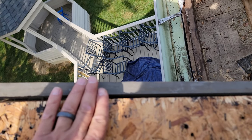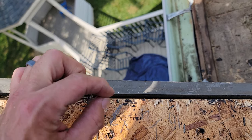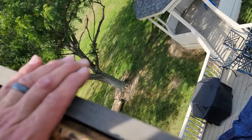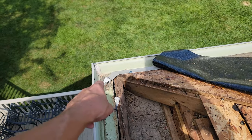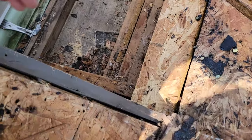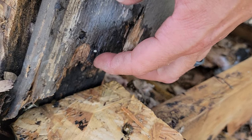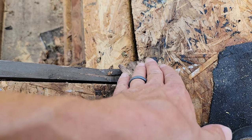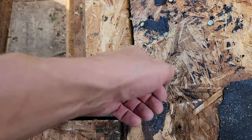Imagine this gable being a bottom eave — water's running off this direction. Your edge metal stops here, your shingle stops there. Water comes off that shingle, surface tension wicks under. Your shingles need to hang over — when they heat, they'll curl down just a little bit, giving it a nice drip edge. With the lack of those two materials and items, you're going to have water pouring in, rotting out fascia boards. That's why this is all rotten out here. As your shingle flash and everything comes up, you need to come up behind your fascia board.